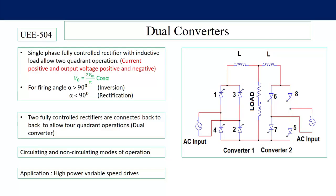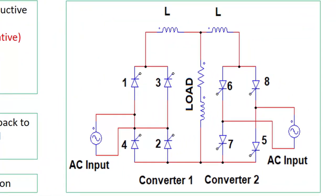You can see in the diagram there are eight SCRs connected. Each group of SCRs is forming one converter. Converter number one has four thyristors and it is nothing but a single phase full wave controlled rectifier. The two converters are connected back to back. Converter number two is connected in such a way to provide negative current to the load. Supply voltage for both the converters is the same.